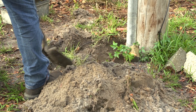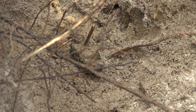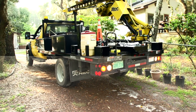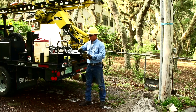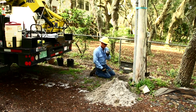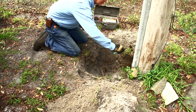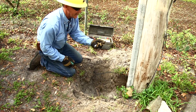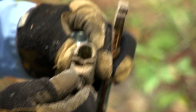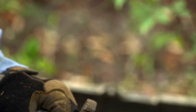Back in the day they put clamps, but when we get done with this, we're going to weld a new piece of copper to the top of the ground. Let's take this clamp off and add a coupling to be able to add to. Not bad shape considering how old. If you can see, there's green inside of this — the copper that's been on here so long gets corroded up. I have seen this be the reason why the ground wasn't good.